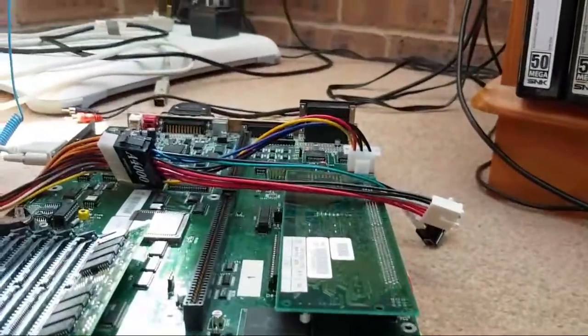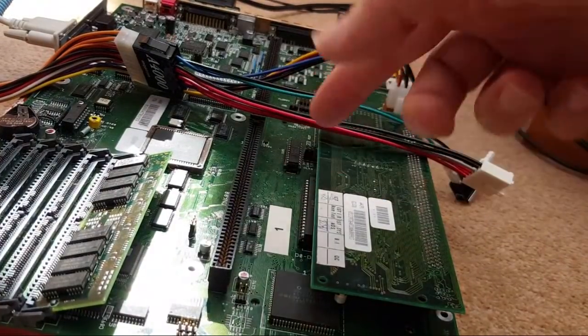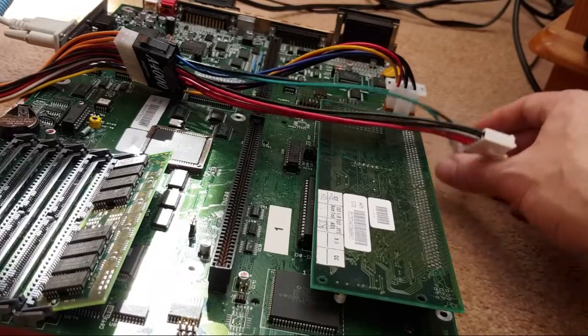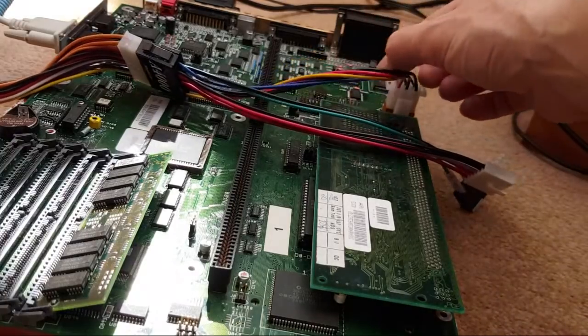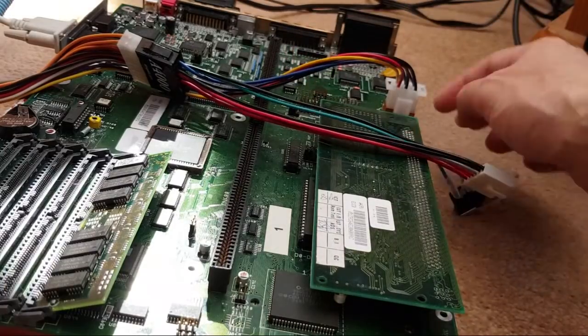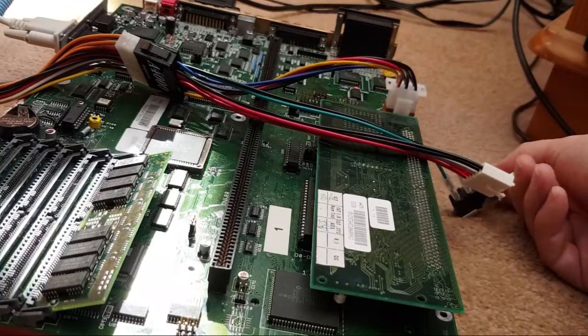Thanks for the suggestions on that, though, guys, about the Kickstart ROMs. But I think we've just proven there that the timing of the Kickstart ROMs, you know, the polling that they apply, is not the issue. It is something to do with either the gals, the difference in the gals. It could be that original HCT one that's on there. Should we swap that?